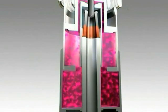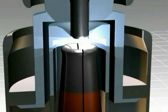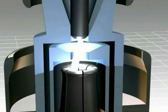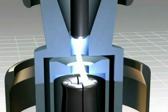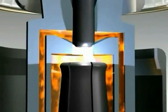During the further course of opening, the arcing contacts open and an electric arc is drawn between the arcing contacts. At the same time, the contact cylinder moves into the base and compresses the arc quencher using sulfur hexafluoride.